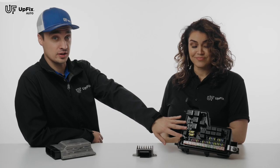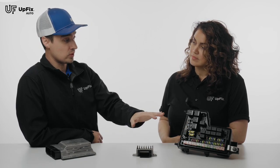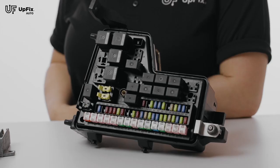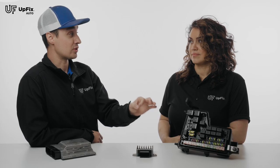As you can see on the front, it's got a whole bunch of relays and fuses. As a courtesy, we check every single one — we pull out all the relays and bench test every single one, replacing any faulty ones. But the real repair happens when we take this entirely apart and fix the relays that are soldered into the circuit board.